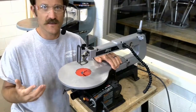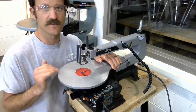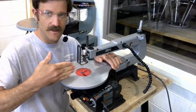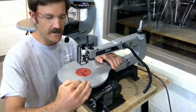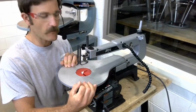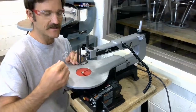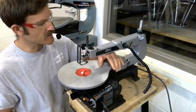The first thing we're going to do is make sure we keep our hands out of the direct cut path of the blade. The blade is cutting in a straight line, in line with the guard. So when we're making our cuts, we're always going to have our hands off to the sides of the blade. That way, if we slip, our hands simply slip past the blade instead of potentially slipping into the blade.